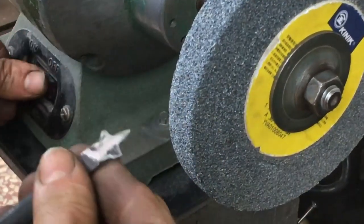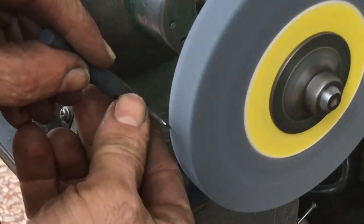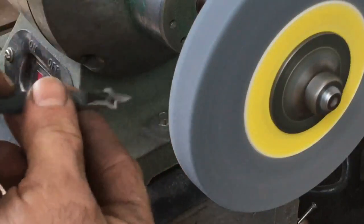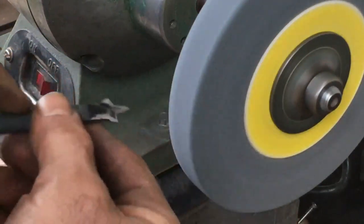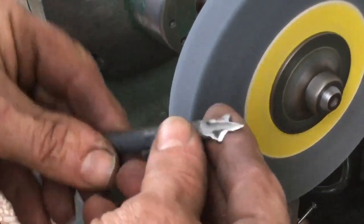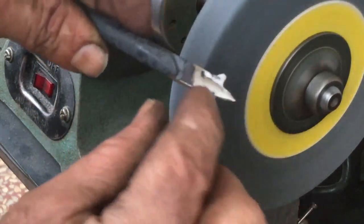So now I really want to sharpen the cutting edges, the flanges, the wings, or whatever. So very simply, I put a little bit of bevel on the back end. That is, as the bit rotates clockwise when it's cutting, the leading edges are flat and the bevels are on the backside. I'm thinking that in this way, it should cut well.